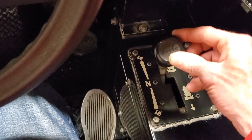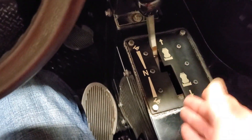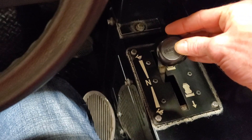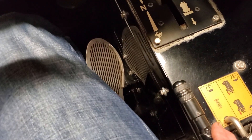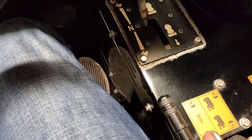One thing to note: if you set this lever barely forward, you're going to have to put your foot all the way down before it engages. If you put the lever all the way forward and barely touch the pedal, it's going to start jumping forward. If it's jammed forward, it'll rocket off as well as come to a roaring stop. Back it off and you can press the pedal quite a bit before the system engages. The brake I call the 'oh shit brake' — I've only gone to it in emergency moments like sliding towards the boards. The emergency brake is required because the machine will roll on a hill.